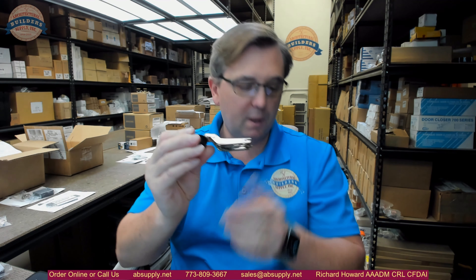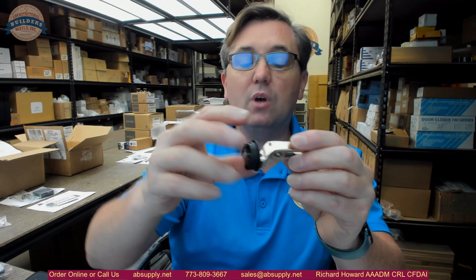Let's remove this from the packaging. This paperwork is the template, which is linked below, and we're going to go over it in a moment. With European style hinges like this, what is naturally also required is a mounting plate. This mounting plate is the EH122, or at least one of them. The mounting plate goes to the sidewall and then your hinge attaches to the mounting plate. There are varieties of hinge types and mounting plates, so you can achieve different installations and different applications through this modular system.